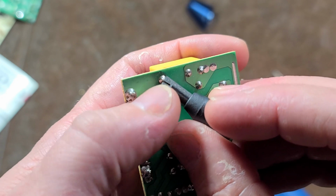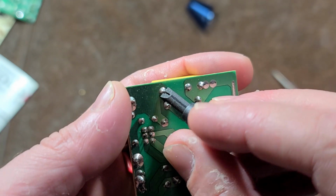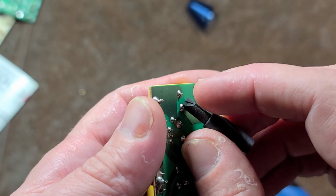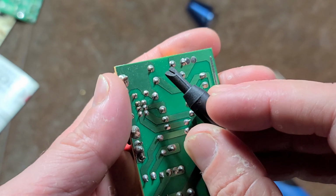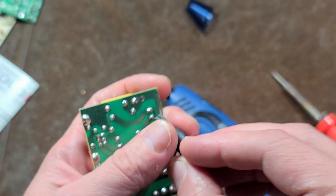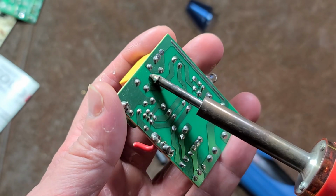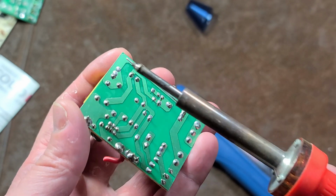These don't really work very well because you can't really flow solder into them for soldering, and for desoldering, they just don't deliver very much energy. Oftentimes the heat just stays too close to the top of the leg on whatever circuit and doesn't get deep enough. So either you don't wick it in or you can't wick it out and remove a component. So that's what's nice about a traditional soldering iron. When you need to actually solder something, you really still are stuck with a traditional type of soldering iron.